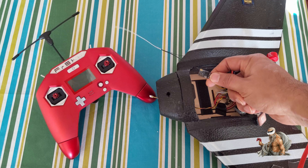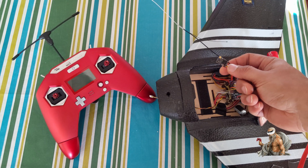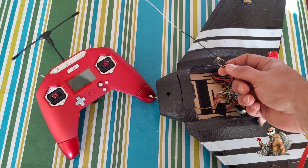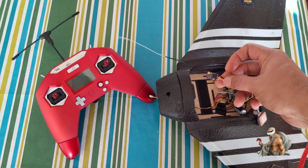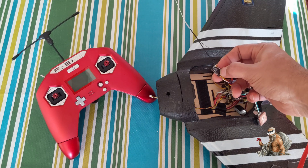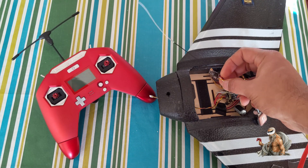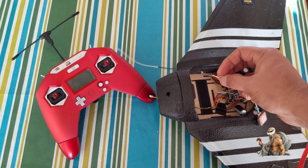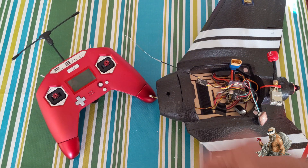Similarly on your receiver, flashing green means it's in bind mode. When you buy a new receiver it's usually not bound — as soon as you give it power it will by default go into binding mode. If not, just press the button once after you provide power. It's not like FrSky or FlySky receivers where you have to hold the bind button and then plug in — that's one good thing about this. Then there is the red LED which means the firmware is getting updated, and solid green means you are now bound to the transmitter.